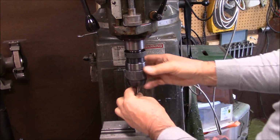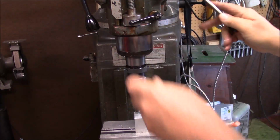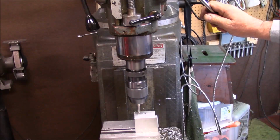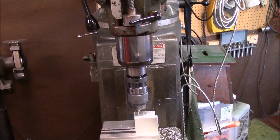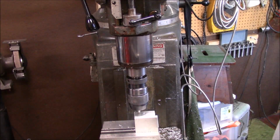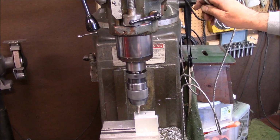This actually was a block of aluminum. You see me saw it up. And so one of the things I'm running into is I don't have enough travel for my adjustment, so to get what I need, I've decided to put an extra screw, move it off of center to give me even more adjustment.